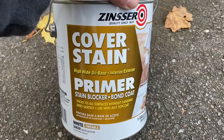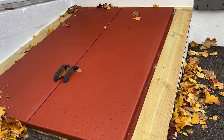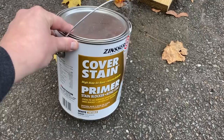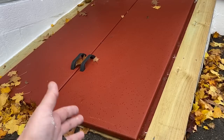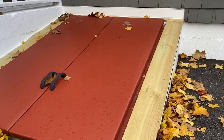It's an oil-based primer, interior and exterior, and it works really well. I'm going to prime all that stuff I just mentioned, except for the bulkhead itself because that is pre-primed. And then I'm going to paint everything with a latex paint — just one gallon of paint. I can tint this if I wanted to do a gray, but I'm going to do two coats anyway. The very best thing for the bulkhead would probably be a Rust-Oleum or something, but I have a special kind of paint I'm going to be using that I'll show you when we get to it.